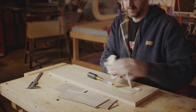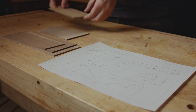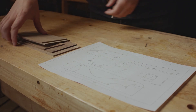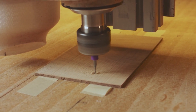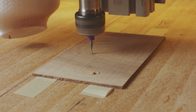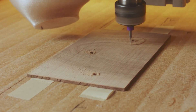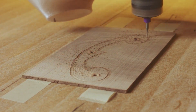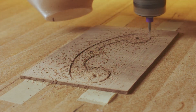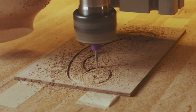My standard method for developing cam involves using stock dimensions defined in the manufacturing environment to create technical drawings. Then I mill rough lumber to the stock dimensions and thicknesses, making the parts easy to produce. Next, I perform a boring operation for the attaching hardware, followed by cutting the profile and angle with my v-carving tool. Some engraving is done on the final piece, after which mother-of-pearl powder can be applied and soaked in CA glue. Once it's hardened, it can be sanded flush.